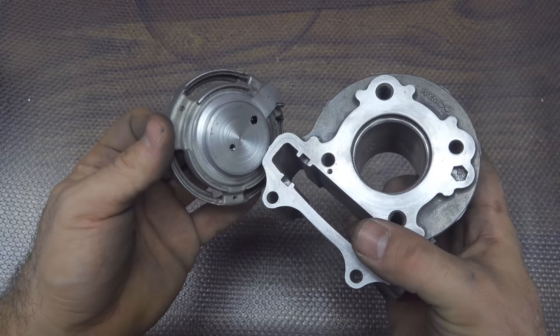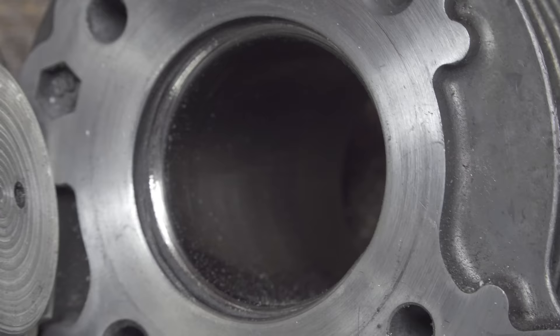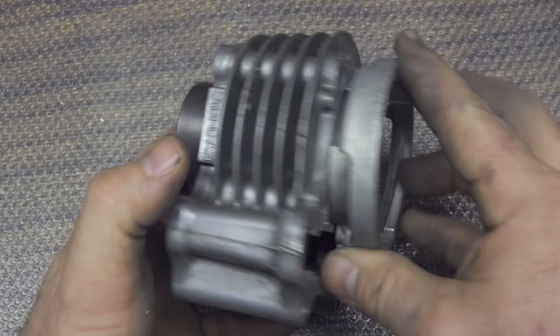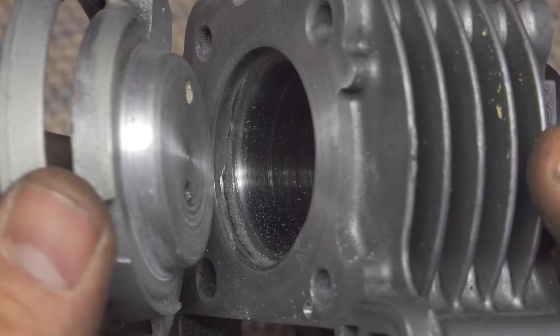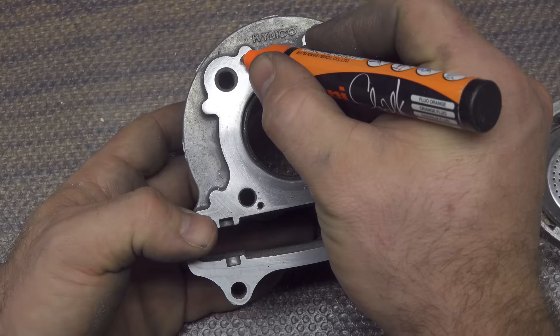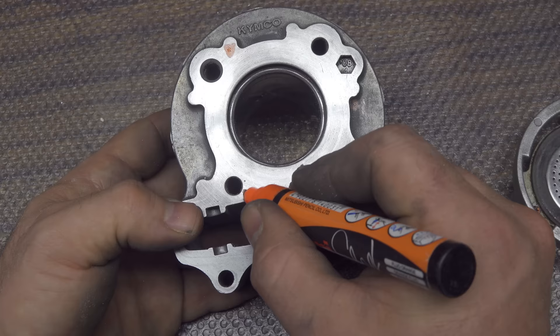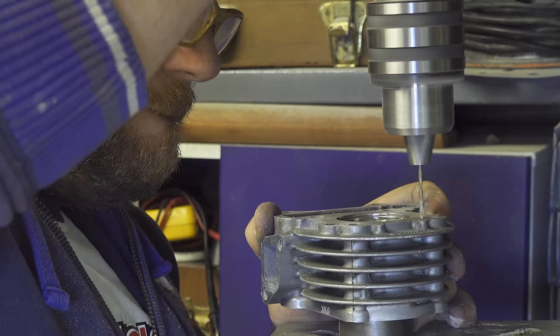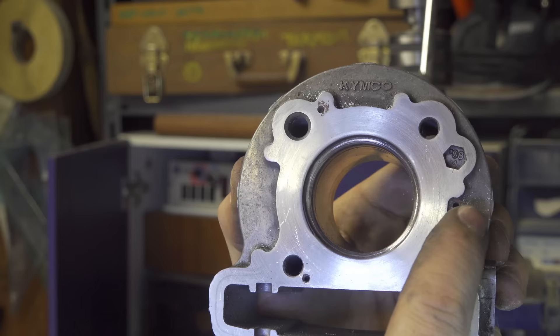The hole is now larger at the base and the coffee part of the original machine can fit perfectly on top. It's also a good idea to seal the parts with a little bit of silicone — non-toxic silicone is very important so we have a tight fit and water cannot leak out. I also mark three holes on top where I can screw three little screws, and drill into the aluminum of the motor head using a very small drill bit, going in about one centimeter — this will be enough to secure the screws.